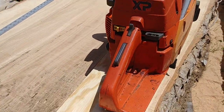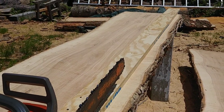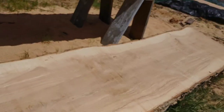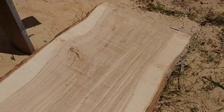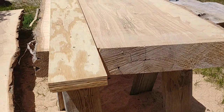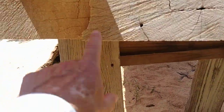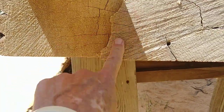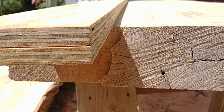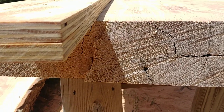I'm gonna make a cut here. This is ash, and I'm making a mantle for a customer, quarter sawn mantle that's coming out of the center right there. So what I did was I milled slabs off the ash, and actually I got them sold. They're under there, so they're not out in the sun. But I got myself down so the pith is perfectly centered. So the mantle is going to be perfectly quarter sawn, dead straight up and down, and it's going to be 4x8 after it's planed. Right now it's at 4.25, and I'll mill it out sideways to like 8.25.